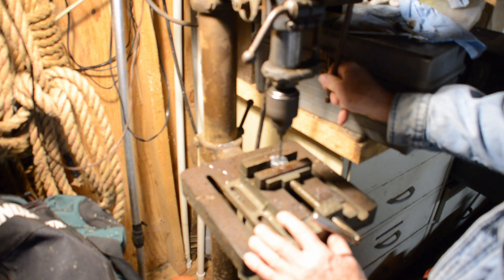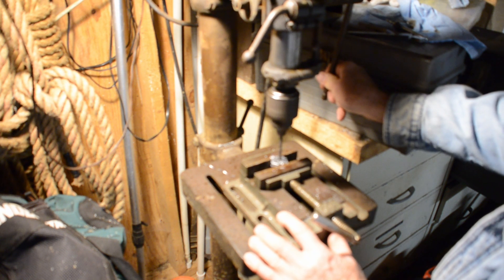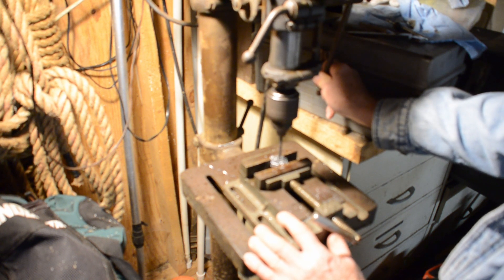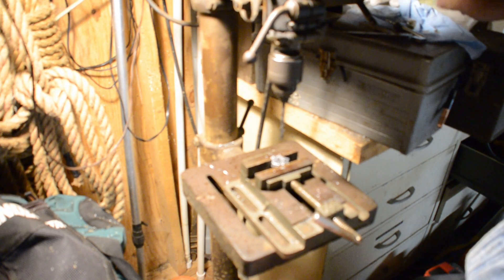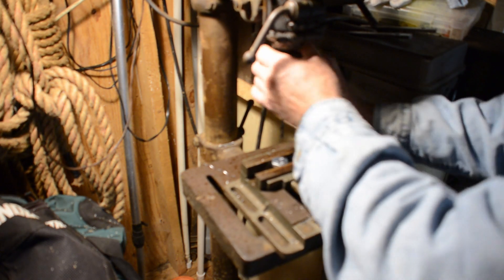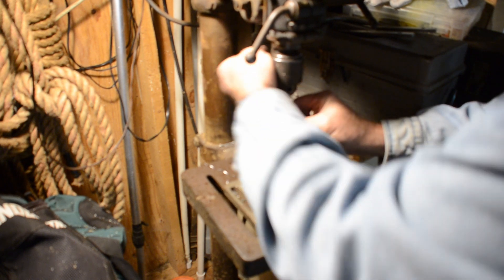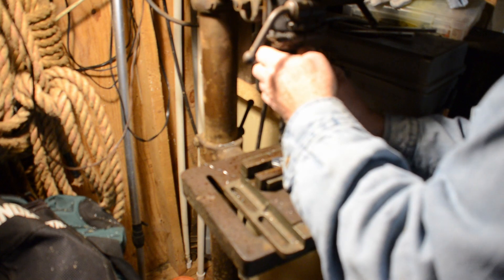Let the drill bit just cut — don't force it. And you can actually do this with a hand drill. One comment from my earlier video: a guy said it sounds like I've got thousands of dollars in equipment. I do not — I have just what most of you guys probably have in your own garage. I'm going to switch over to the number S drill bit now; that's going to be for the 1/8 national pipe thread. I may get a little chatter with this, and that's okay — just take your time.